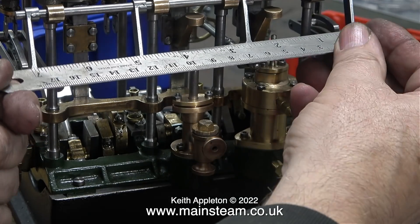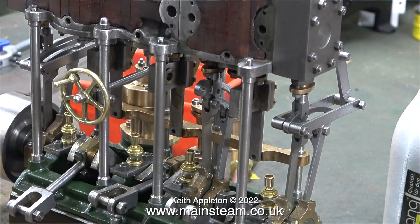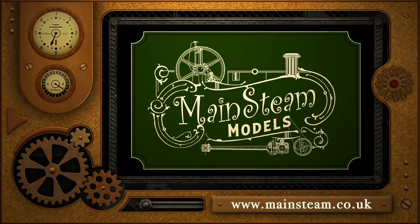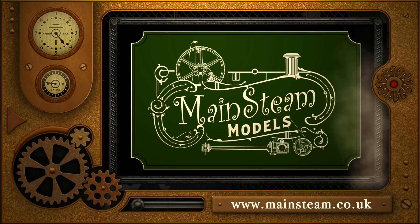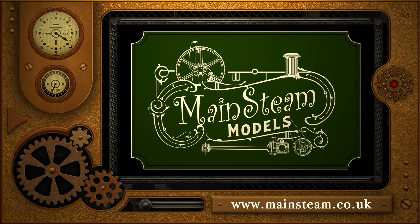To illustrate the fact that all four drop arms are perfectly aligned with each other, I'm using a ruler and it's touching every one of them, which is a good thing. At this stage I'm very tempted to bolt it all together and start the valve setting procedure using compressed air, but no — it will just become an oily mess. What I'm going to do is fit the cylinder cladding first. I also need to buy six of the taper-type cylinder drain taps, and before assembling the engine I need to drill the holes in the two operating arms that move the air pump and water circulation pump — but that's in another episode. Stay healthy, thanks for watching, and I hope you found it useful. Please visit my main steam models website and click on the video playlists section to find other videos and watch them back to back.